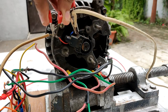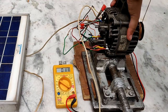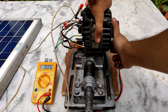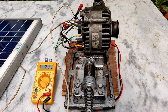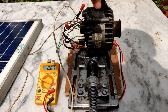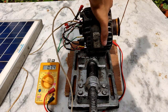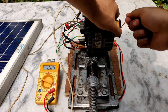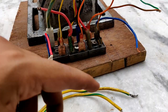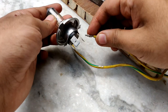The solar panel wires have been connected to the brush and rotor terminals, and the alternator rotor winding is now excited. After winding the thread and measuring, the generated voltage was 9.22 volts. Trying once more a little harder, the voltage increased to 10.25 volts DC. Since the output from the rectifier is direct current, I can also measure the current in 10-ampere mode. The current was as high as 7.57 amperes, and on a second attempt 5.18 amperes. I'm going to extend the final output wires and connect a 60-watt car headlamp bulb to test if this setup can glow it.